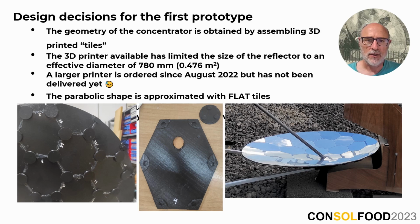In the implementation of our concept, we prioritized accuracy while also avoiding the need for complex manufacturing methods or advanced machinery. To this end, we utilize precise but readily available technologies like 3D printers. Our strategy consisted in constructing the reflector shape from basic tiles, so that thanks to the unique geometry of each tile, when assembled, they collectively form the required shape of the assembly, without requiring any special molds or features, as you can see in the final shape of the reflector made of these parts and connected with those small plugs.